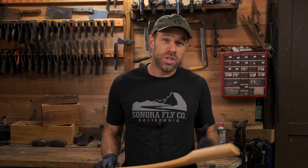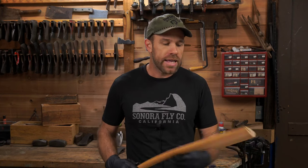Generally speaking, a knot and wavy grain are bad, and a big knot would definitely be the worst, but generally speaking there are no knots in axe handles — that stuff gets graded out at the factory. We do see run out. So why is run out not the number one thing on my list for beginners? If you don't get the right size handle, it doesn't matter if there's grain run out in it or not, because the axe head doesn't fit on the handle. Grain run out doesn't become an issue if you can't swing the axe.